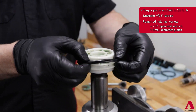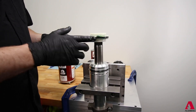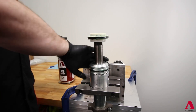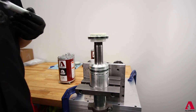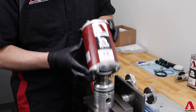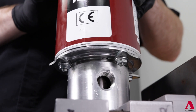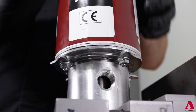Before reinstalling the motor, replace the large outlet body o-ring. Using the lubricant supplied with the air motor replacement kit, apply a liberal amount to all the seals. For new air motor heads, there will be a large amount already applied to the cylinder. Simply slide the cylinder over the piston at an angle to slightly compress the quad ring. Once fully inserted, tilt vertical and press the assembly down on the outlet o-ring.